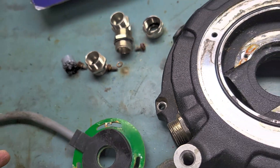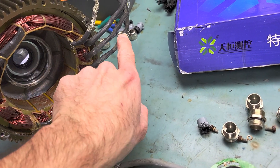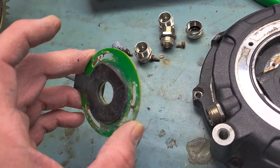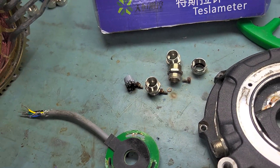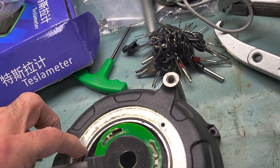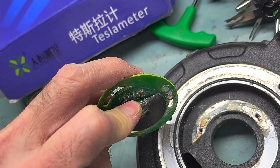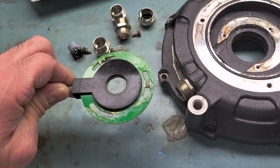When you get water between that potting and when there's a not very good bond of the potting to the PCB, you can see very easily all the small components — capacitors, resistors, hall sensors — and there was water here. That's what's making the problem, because this is exactly the sensor that tells your motor controller the rotor position, to be able to control the phase current going inside the motor to make it rotate. When the sensor goes bad, it will tell the controller the wrong indication. I searched on the web and everyone says just replace the hall sensor, but nobody really wanted to investigate why. I took that piece and tilted it at an angle, saw a little clearance, decided to peel it back, and saw all the circuits with water.